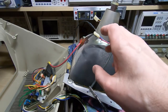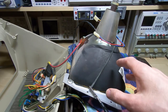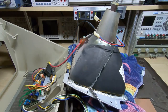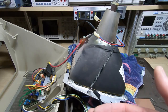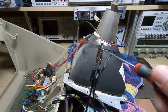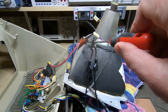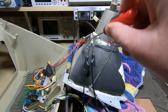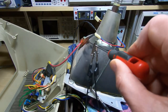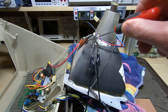I've got the tube unbolted. The next thing I need to do is disconnect the EHT cable. As I've mentioned previously, the CRT is effectively a very large capacitor and it could have up to 12,000 volts charge on it, so I need to make sure it's discharged before I attempt to disconnect it. The easiest solution is to attach some ground leads as I've done here, clip the other end to a screwdriver, make sure you've got plenty of insulation at the end, ease this gently underneath the cap and push it in all the way, keeping your fingers well away from the metal. If there's any charge in there, you'll hear it discharge. Do it several times and leave it in there for a minute or so to make absolutely certain there's no charge on there.